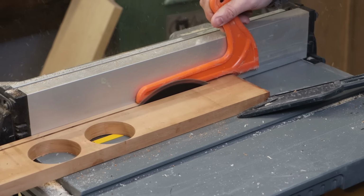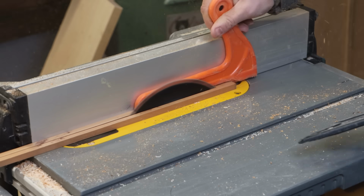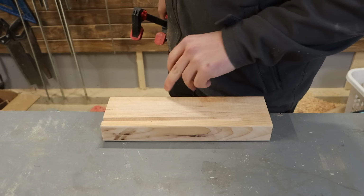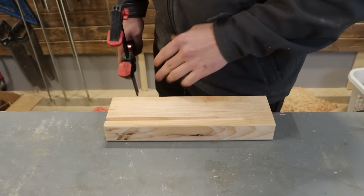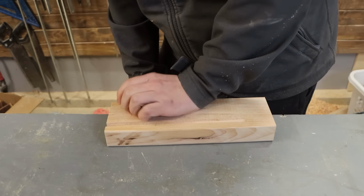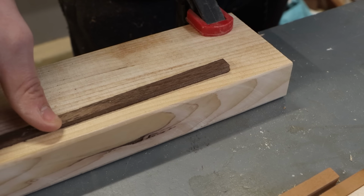As long as it's at least 3/8 inches thick by 3/8 inches wide and 9 inches long, you can really use any scrap wood piece for this. So now we're gonna clamp our jig to our workbench. The reason we put this slit further away and not in the middle is because we needed a place to clamp. The way this jig works is you place your piece in there, then slide it till it hits the end.